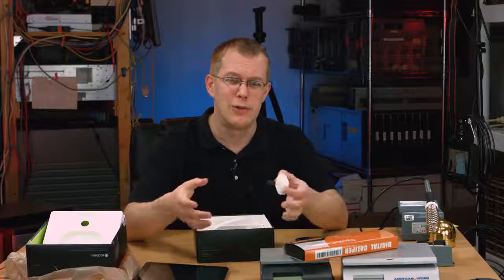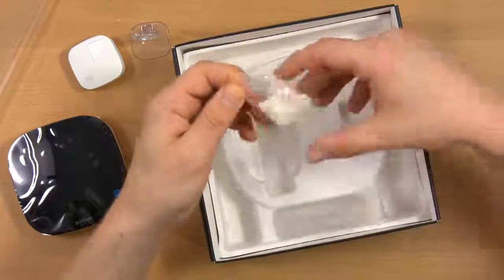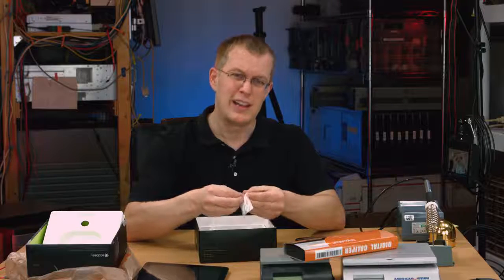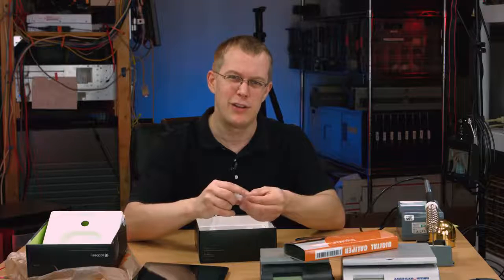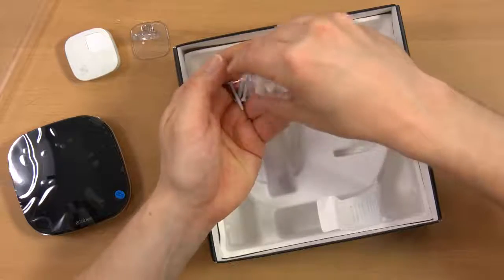So the second floor is about 7 degrees cooler on average when the AC is running than the first floor. But of course, during the day, we spend most of our time on the first floor and we do not occupy the second floor. So the second floor is being cooled a lot more than the first, a lot more extensively. And that probably really messes up our cooling bills, our electric bill. So we'd probably be better off getting a second zone installed. But until then, I'm hoping that this temperature sensor at least helps a little bit to balance things out, even at the expense of overdriving the AC at times on the second floor.